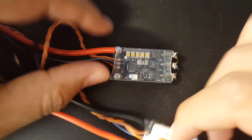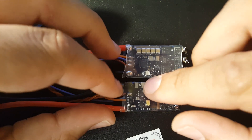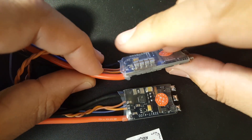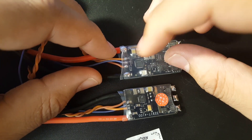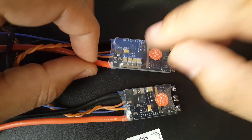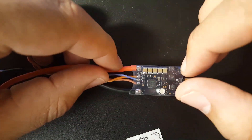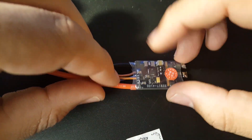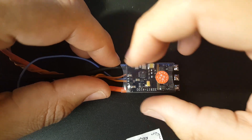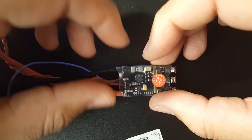Flipping to the other side: the 42 amp has one more capacitor on this face, giving a total of six fat caps. The 52 amp has nine fat caps total. The 42 amp also has a small tantalum capacitor, which should help with noise, and a current sensor — which is good to see.